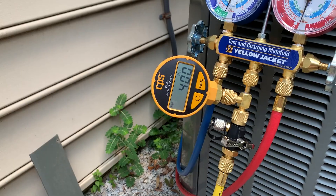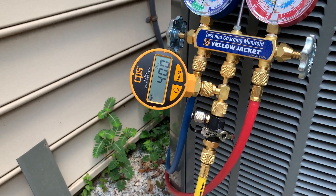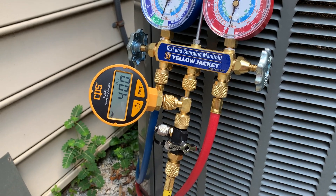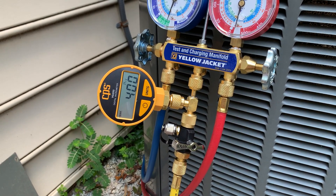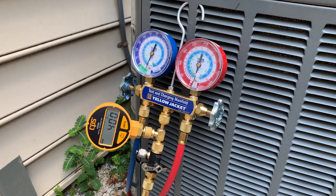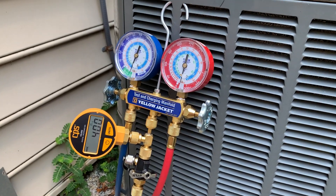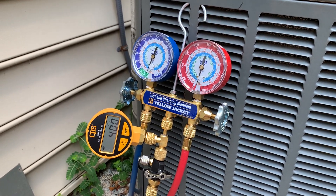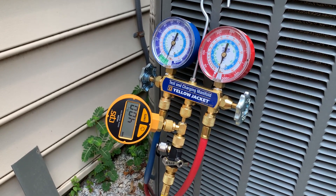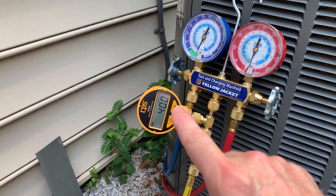The gauge was giving me a little circular motion across the screen, no numbers, and it did that for almost two minutes. I was actually freaking out — like, I've got a major leak upstairs — because I did braze-solder on the filter dryer line, the high pressure line, the low pressure line, everything upstairs in the attic. I did not do a pressure test; I didn't have the nitrogen equipment to do that. Probably if I could go back and do this over again I would, but I was like, you know what, I'm just going to try it — worst case I go get the stuff and pressure test. Anyway, two and a half minutes in I saw the pressure way up around 55,000 to 60,000 microns, and then it started coming down pretty fast, a lot faster than I thought it was going to.